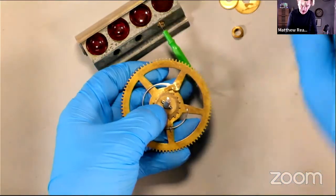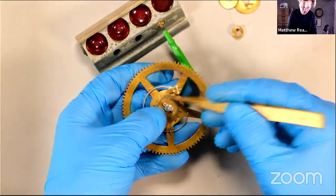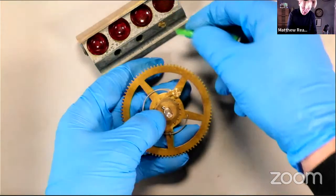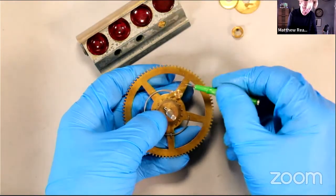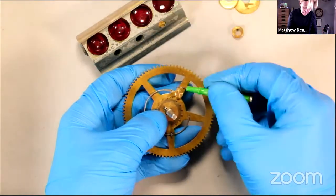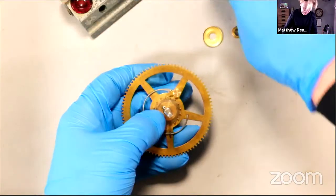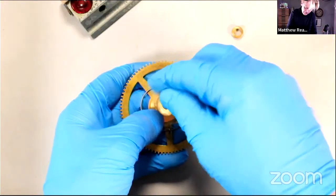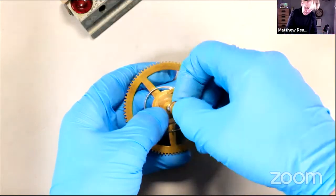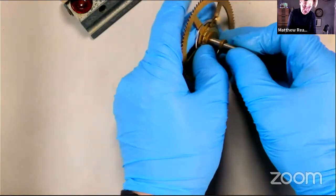There we are. So I've just oiled where the click spring touches the click, and where the rivet touches the click as well. It's quite gloopy oil. Maybe I should have used thinner oil. Anyway, plenty of it on there. Then that chap on, then that thing on, and this thing on. And then we just want to sneak in there with a little bit of stud lock.